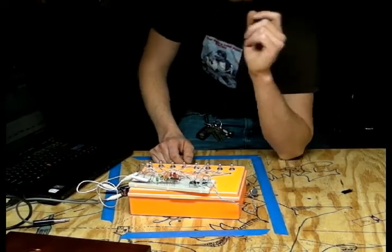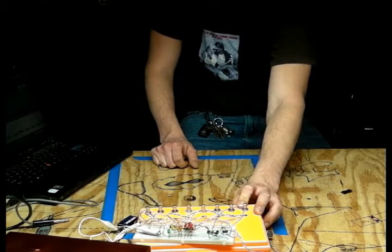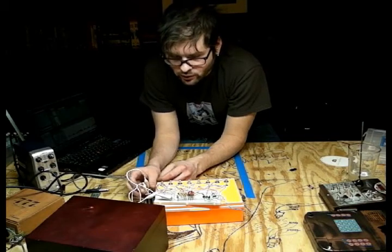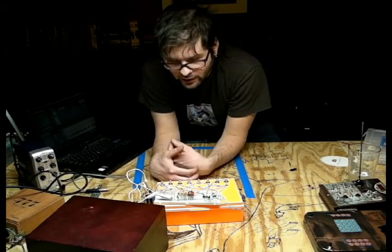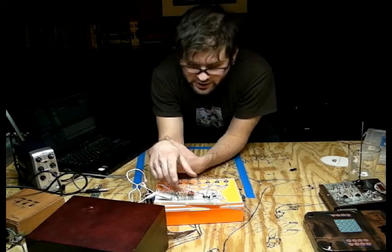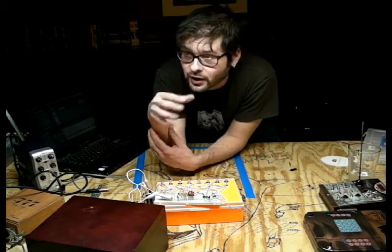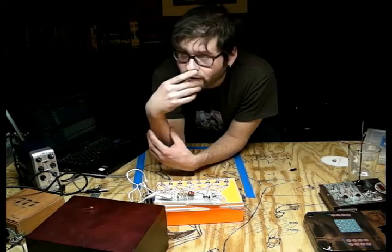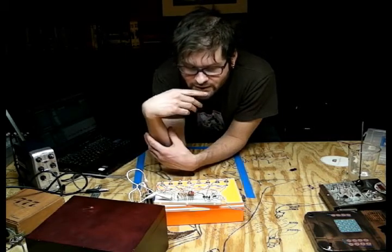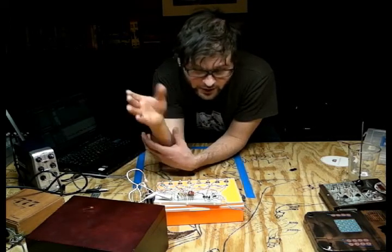In conjunction with the beginning of your lecture, wouldn't it almost be easier to make each of those LEDs a Vactrol unto its own, like what Una has been doing recently? I think he uses one LED, and each one of the transistors changes the brightness of the LED, and you can use that Vactrol. There are several ways to do it, but this is the way that I started off with. This is the first breadboarded sequencer that I made, and it's worked well for me.